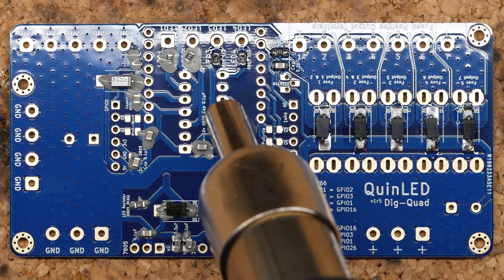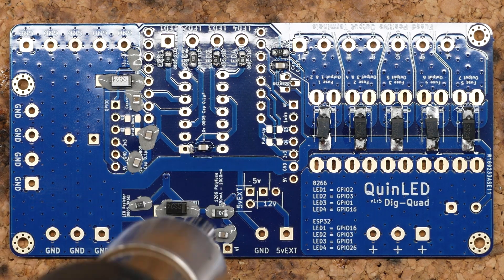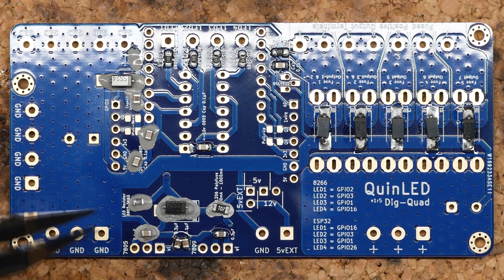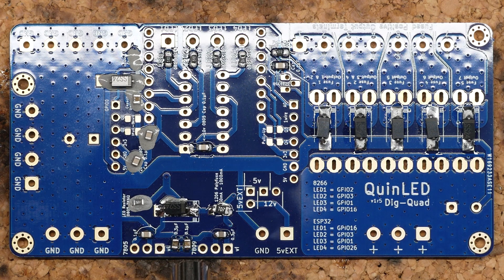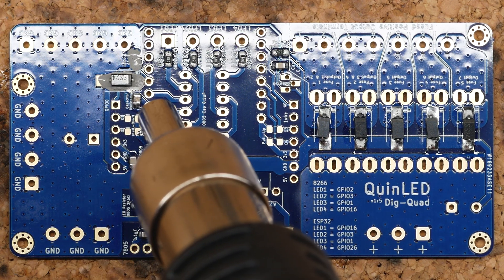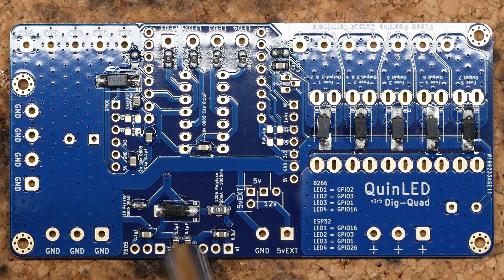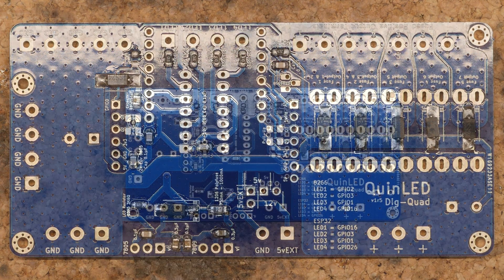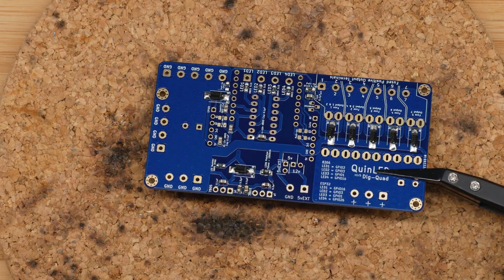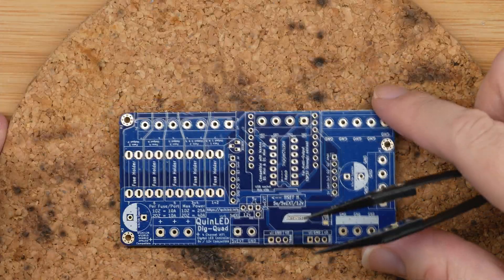This is what makes SMD soldering so nice — because of the surface tension of the solder itself, it basically pulls all the components to their right spot. Nowadays hot air soldering stations aren't that expensive anymore. The one I'm using is only 30 bucks, and I'll have some links in the description. I'm also testing a new soldering station which has hot air and an iron combined, but that video isn't out yet, so stay subscribed. This video has been sped up four times, so it's pretty quick — it takes a little bit longer in real life, especially if you're doing this for the first time.